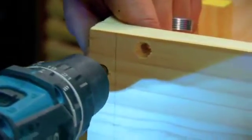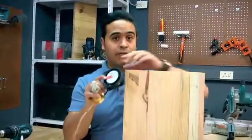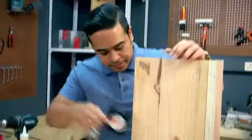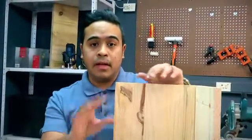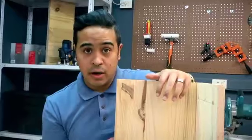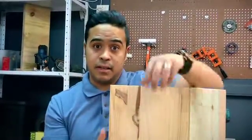To build the box, start by adding glue and secure the left-hand side and the back of the box. With the left-hand side and the back now securely attached to the base, we now need to make place for our fan and our light or heat source. So we're going to place this in here, but we're going to cut louvers in the back of our backboard to enable air to flow through and circulate throughout the system. After that, we can attach our right side once we put our dowel sticks in place.